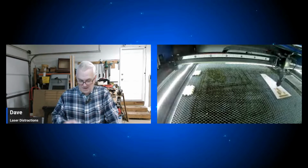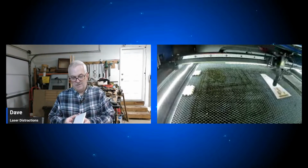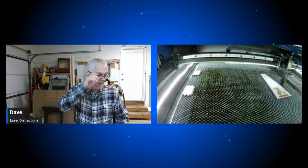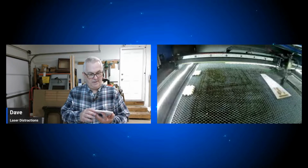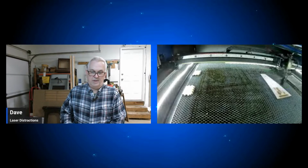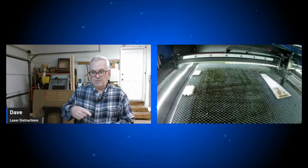I've still got 3 of these white tiles, but I think what I'm going to do is grab a can of black and paint over, because it's got a layer of white down. And then I'll put a layer of black, and then we'll try doing those. With those, you invert the image, and hopefully the lighter parts you want to burn through the black and get to the white. But usually when you do the black, the white, then the black over that, you can't take acetone and clean them off because it just wipes off what you just carved out. So when you use that method, you want to take some clear and put it on or something.